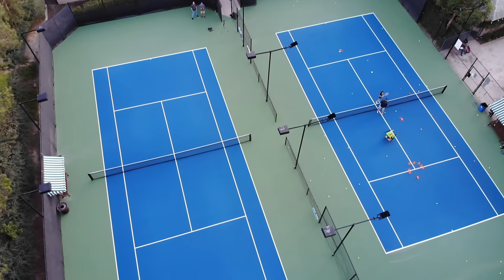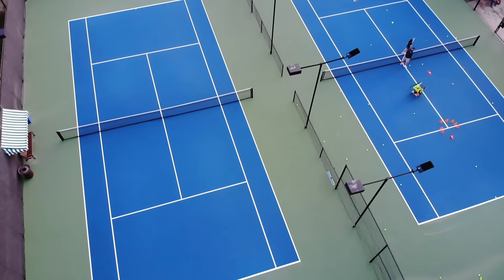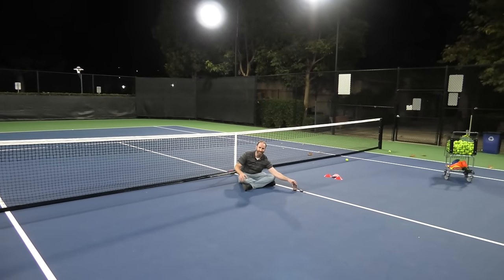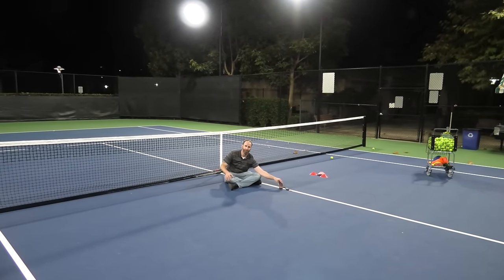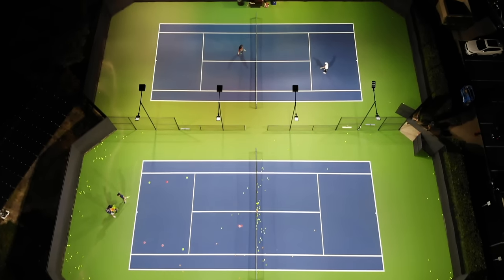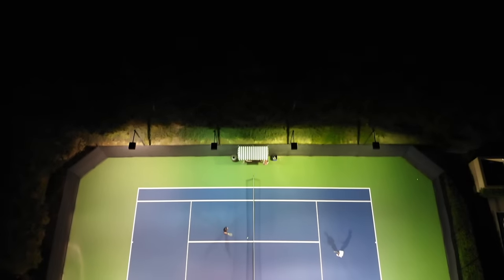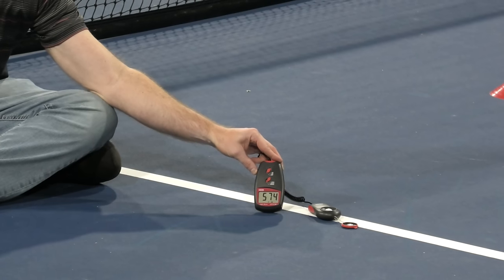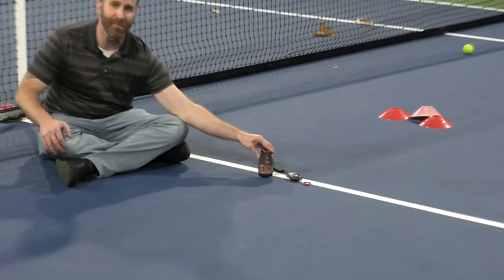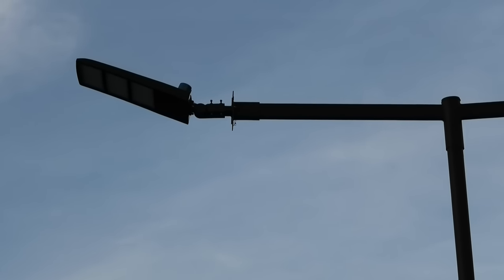Here on the court with the new 450-watt Next Gen 2 lights installed, we're seeing a 574 lux reading at mid-court with very even lighting throughout. This easily reaches USTA and ITA standards for lighting on a tennis court — a 200 lux or 20 foot candle increase over the old metal halide lights, with well over 50% energy savings. The key is doing a photometric study to plan for specific brightness goals, ensure even distribution, and prevent light from bleeding off the court and bothering neighbors.